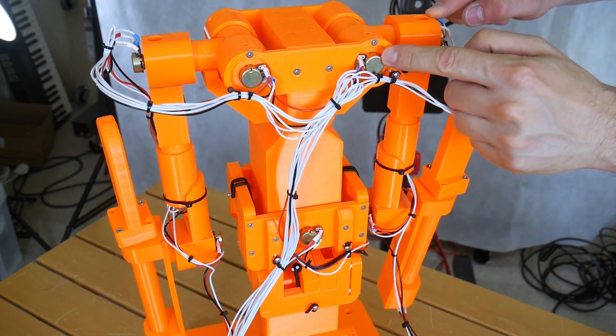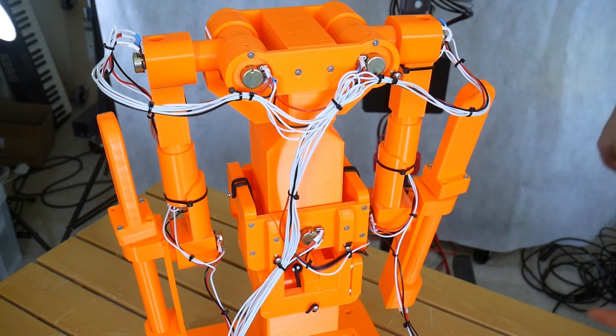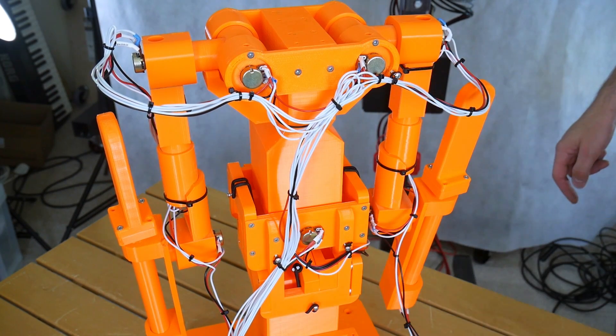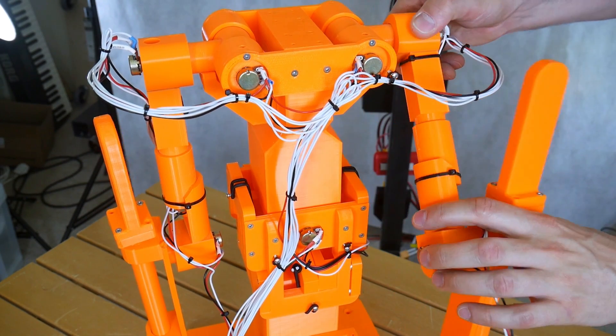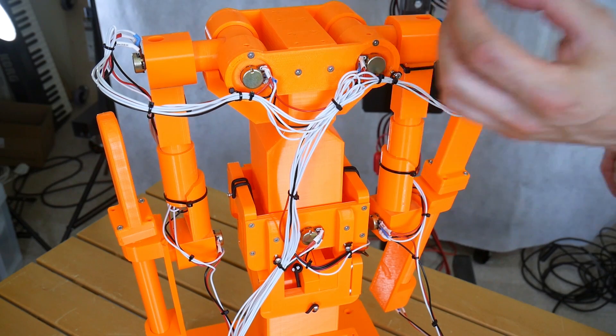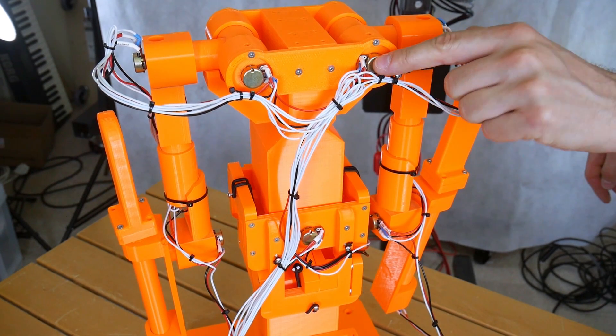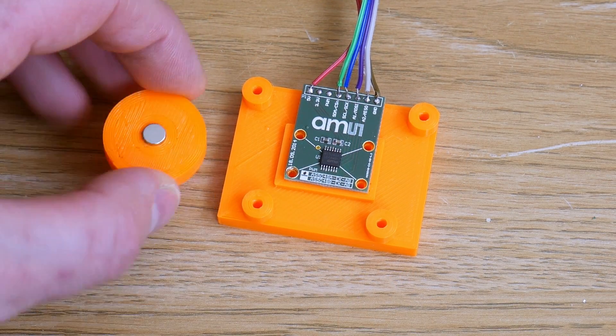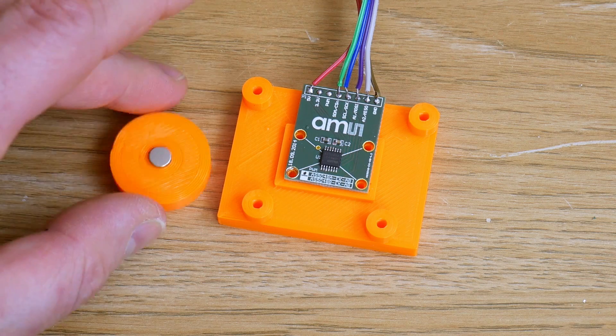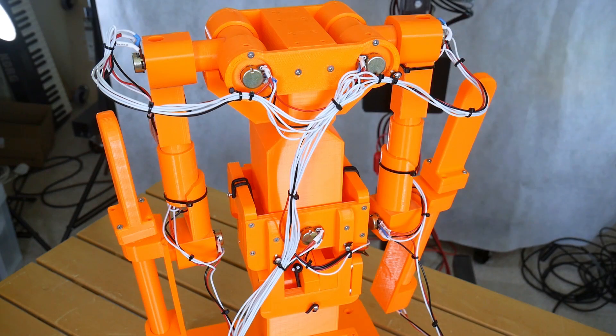I'm sure there are people shouting at the screen saying these pots are rubbish and will wear out - they're meant for a volume control on a hi-fi. They're not supposed to take any load, and they're also holding all the joints together, which isn't ideal, so they'll probably wear out and we'll get noise on them. The plan is eventually to replace the pot shaft with a six millimetre steel shaft, put a magnet on the end, and use the AMS Hall Effect sensor rotary encoders I used on the robot arm. Those cost £12 each instead of 99 pence though, so to upgrade both robots with all 12 joints is quite excessive for now. We could put high quality pots in as well, but they probably cost about the same amount.